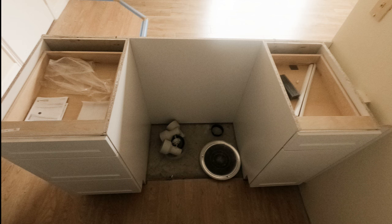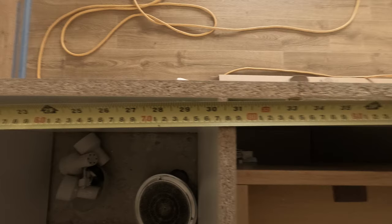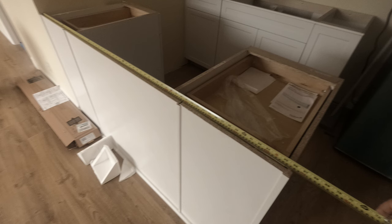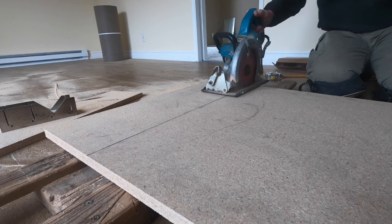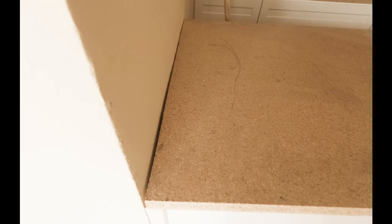Now let's get that stove side countertop fitted. First, I want to make sure I have enough clearance for the stove. I measure the opening at the front and the back — I'm looking for at least 30 and 3/16ths between the cabinets. I have 30 and 3/8ths at the front and 30 and 5/16ths at the back. I'm going to treat this range opening as though the side cabinets were backed up to a wall, putting a piece of 1x2 on this end, but still cutting it with a quarter inch overhang — 66 inches should be perfect. This one also needs to be scribed to fit, and our laminate deck will also have to be scribed in. This brings our open end back to where I want it.